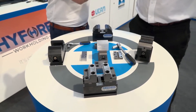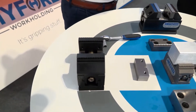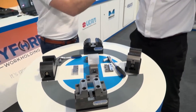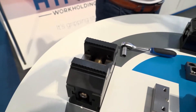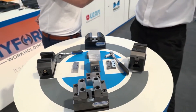They come in different sizes? Yes, this range can go up to — they can do specials of up to 500 millimetres in length, so for a five-axis machine it's obviously quite a range. What about the clamping force? Clamping forces are dependent on the vices and the size, but it's significant — it's got enough force to crimp components manually. Yeah, there's definitely enough force going through them to crimp all sorts of components: hardened steel, titaniums, and all sorts.